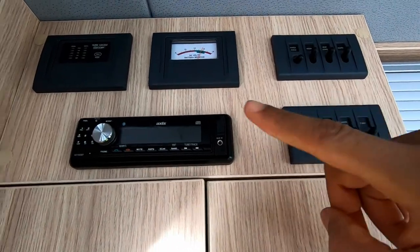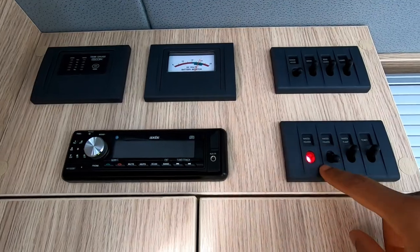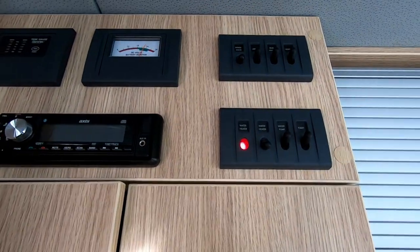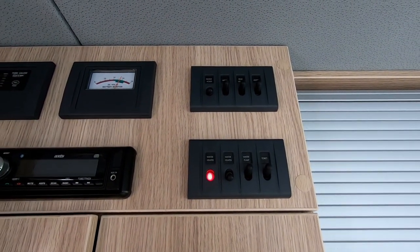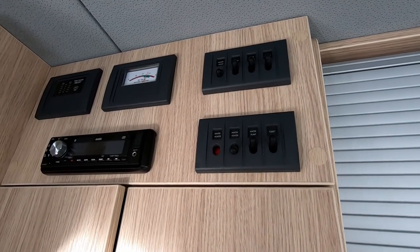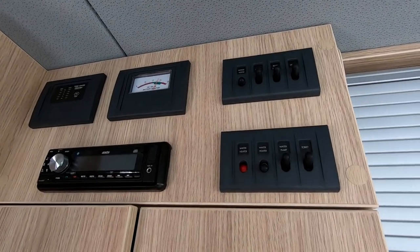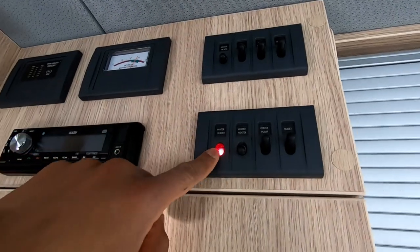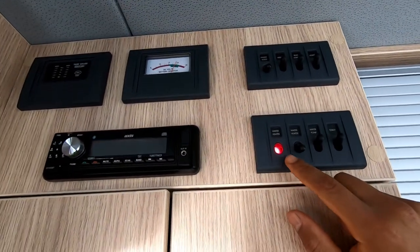Normally in your camper when the tank is full, turn the water pump on, leave it on, and then turn the water heater on. Now we wait for that light to go off. If you listen closely you'll hear the gas heater light — there's the click.